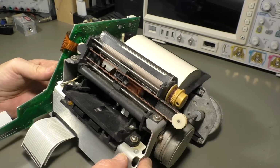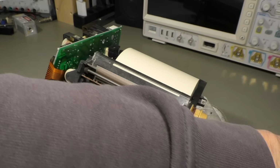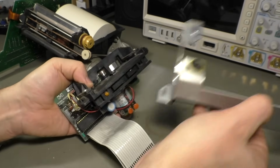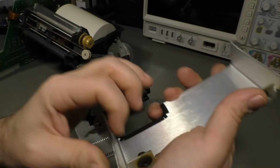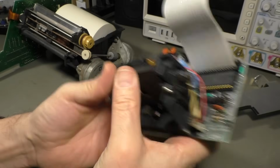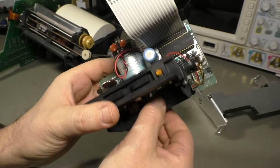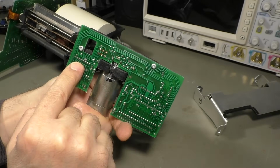Okay, tape drive. We are still not there. Okay, so that's how this works. Now I've already removed those screws. There are also rubber mounts. They are in relatively good shape. Still elastic. Okay, no problems with that. There is another big chip and another HP proprietary one. Okay, that's the motor driving the pulley. That sounds good. Maybe could use a drop of oil here. There's another HP chip. I guess that's probably the head amplifier.